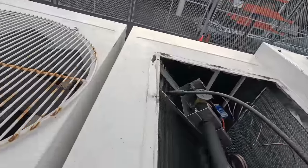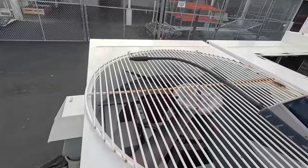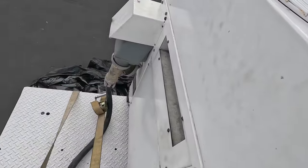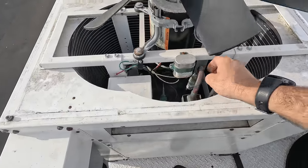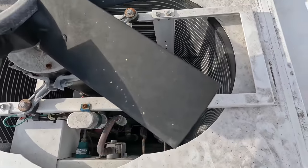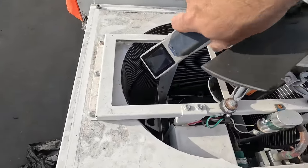For the most part, just going through and seeing if there's any major leaks, then we'll go ahead and do the regular checks and make sure we don't have any problems. Got the power hooked up here. What's crazy is how they've ran Parker hoses on everything. They do have a sight glass there. The part that was leaking last time was down here on this receiver — it was pretty bad. It leaked oil everywhere, had to add oil to it. Not picking anything up on that now.